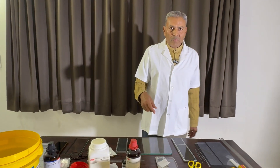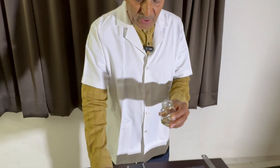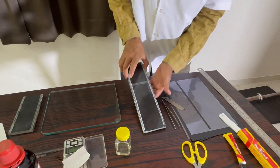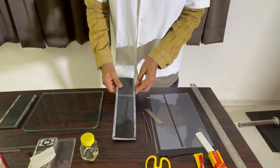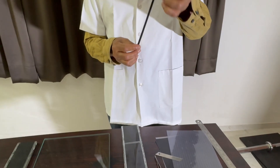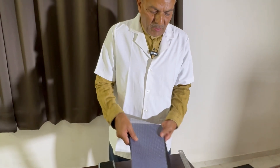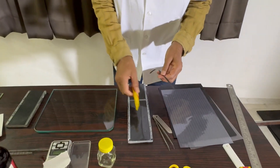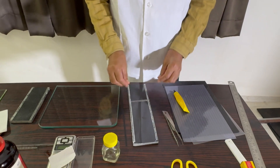After 1 hour, after dissolution of the powder with solvents, the glass plates or granite plates are taken. Both borders of the granite and glass plates are stuck with a plastic material. The thickness of this plastic material is about 200 micrometers, and this strip is prepared from plastic sheets available in stationery. We will stick this plastic material on two borders using Fevibond.